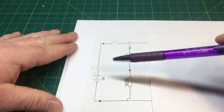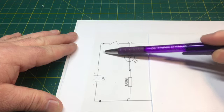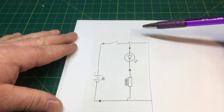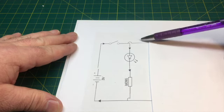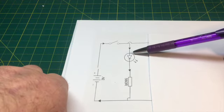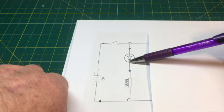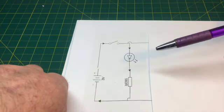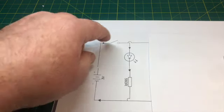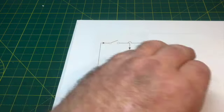So we've got our two AA batteries giving us 3 volts, and this runs out here over to the push button switch. Should have been a push button symbol, but couldn't find one. And this is running through one of these 560 ohm resistors here, and through the green LED. This is just the dropping resistor for that LED. Right, so that's an easy bit. So when you press the button there, the green LED lights.